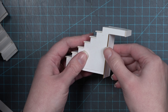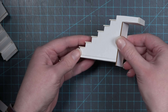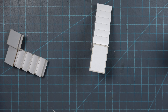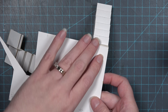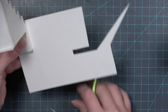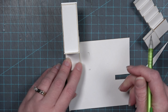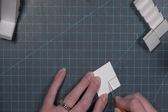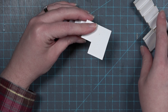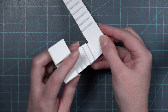Another thing I'm going to do is add an extra long panel along the back of section one. When the stairs are in place, you can see the shag rug carpet showing out of the bottom — I've never seen stairs where there's carpeting underneath the structure — so this extra long piece is going to cover that when the stairs are in place. I also need to add this top tread, which doubles as a platform where the second section can rest. I'm marking out how big I want it to be, then creating a little L-shaped jut-out that goes in the direction where my stairs go up to the third floor, using my stairs as a pattern to know how thick it needs to be. Once I'm happy and have dry-fit everything, I can glue it in place.